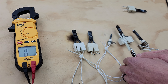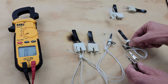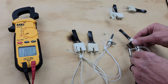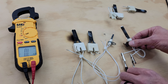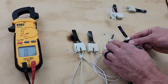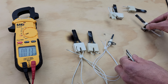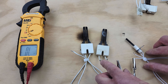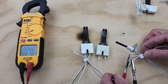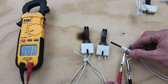We're reading OL on the silicon carbide that has a visible crack. Here's a different type of silicon carbide — a spiral type — and you can see this one is also cracked right in the middle. These are an older style version of a hot surface igniter, and there are a lot now that are mainly just silicon nitride. Once again it reads OL, so that one's completely broken open. Now let's measure the electrical resistance of our silicon nitride — we're measuring 48 ohms, so that one is good.